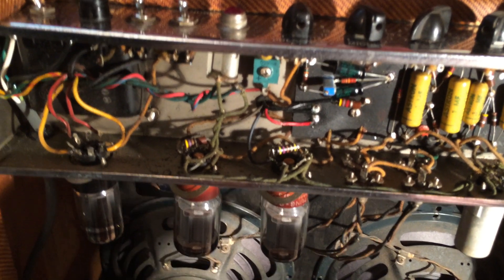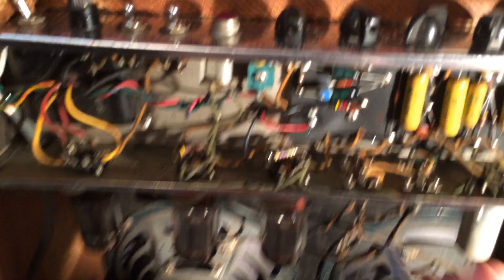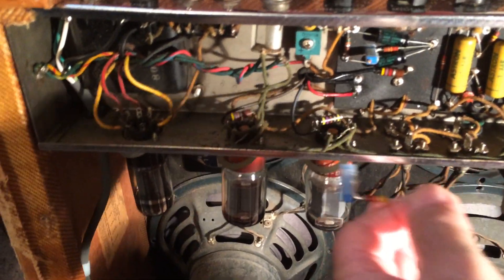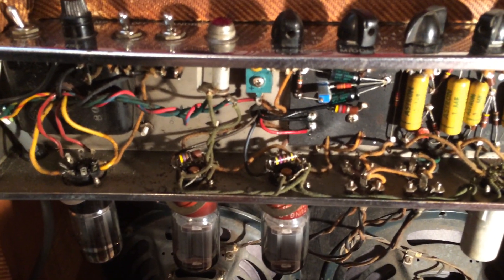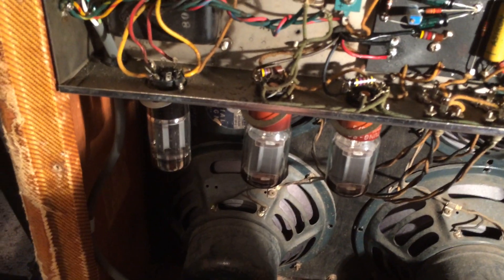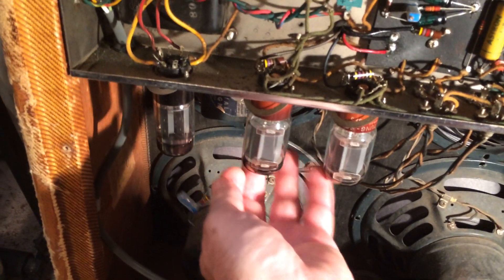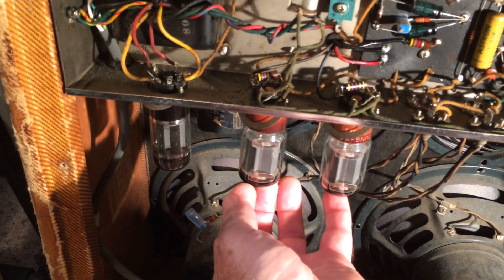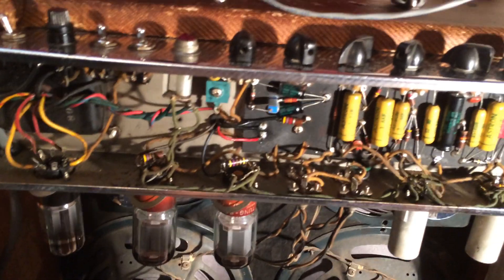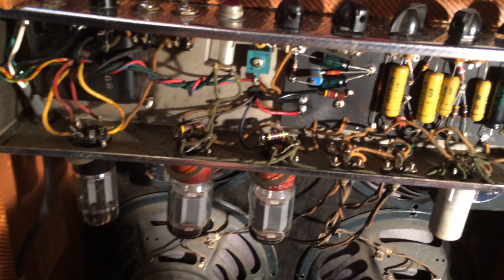The difference between a 61k and a 59k resistor can change your bias maybe six or seven millivolts. So just get a handful of 56k resistors anywhere from 56k to 60k or maybe lower in that range. It took me five seconds — I took out the pot and put the resistor in. The 59k was a little hot, so I found another set of 5881s — old Tung-Sols — put them in, and they were perfect at 31–34 millivolts. Sounds great, very clean, a lot of high-end, sounds a little more like a Marshall to me.